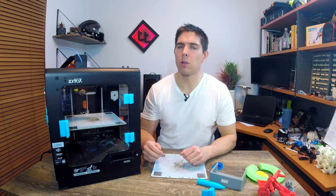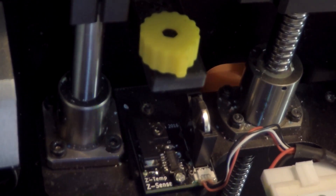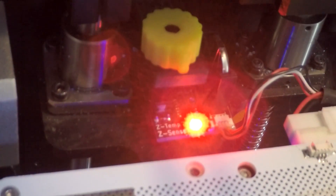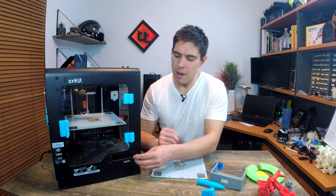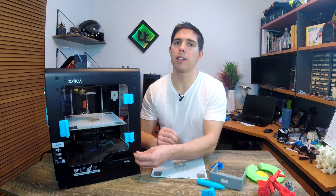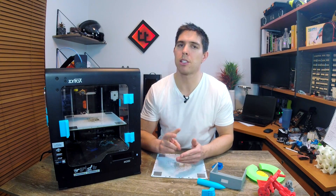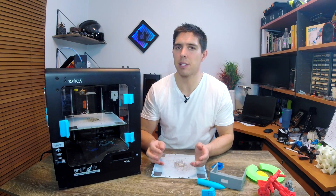To counter this, we installed a Z-sense system which puts a normal micro switch there. The plug simply switches over and we can adjust the Z height manually, like on many other printers. Think about this: when a print is running, everything on the display is unresponsive — turning the dial, pressing the knob, nothing does anything. That means there's no way to pause the print, stop the print, or adjust feed rates, speeds, or temperatures — any of the things we take for granted on Marlin firmware-based printers.